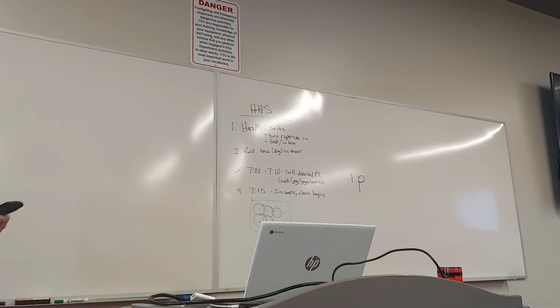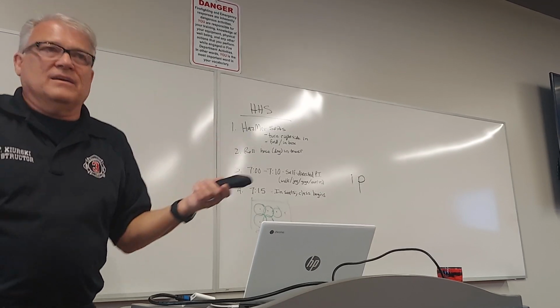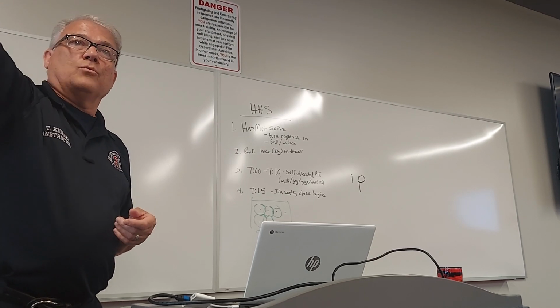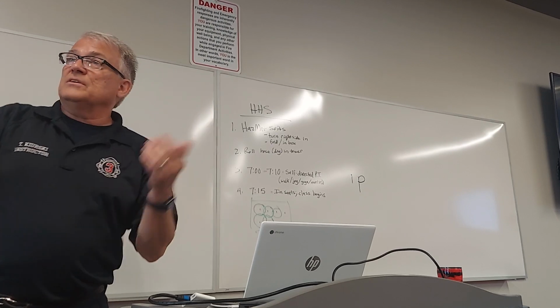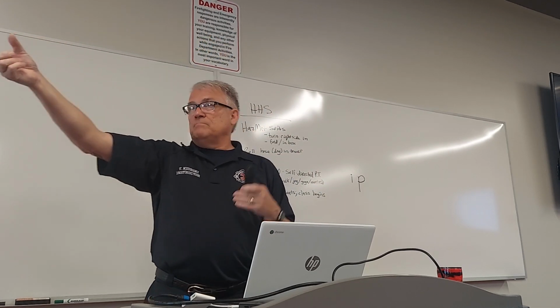If the system does not need that water and just one sprinkler head is going, it's going to sit just like the water behind that faucet right there. It's sitting there, static. It's not doing anything, but it's there. McLaren, open that valve up for the water. Turn the water on. Yep, there it is. Shut it off. Still sitting there. Okay, so that's exactly what happens when you put water into an FDC. It sits there. If it needs it, it'll use it.